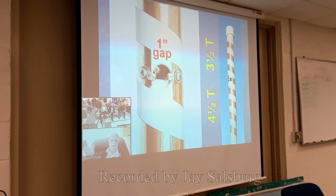I used a Harbor Freight step drill, great for drilling large holes in thin surfaces. And that hole is for the feed point, where the coax runs up the middle of the pipe coaxially and has a couple of ring terminals on the end, makes a sharp bend, and screws onto the PVC pipe through the 3/4-inch hole, and then you tap two 6-32 threaded holes through the copper tape, and then with a couple of stainless washers and screws, you attach the coax to it.